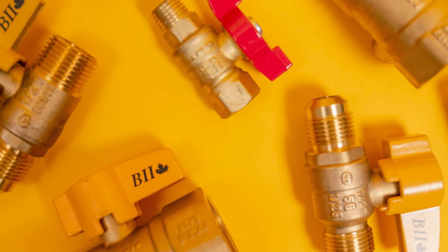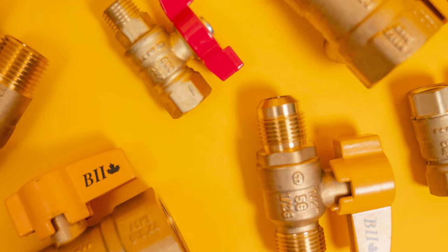Let's talk about the different types of balls. There are three different types of balls that can be found in ball valves. For each of these three types, the outside of the ball needs to be smooth and the surface gets ground down to remove any dips or imperfections. As the material cools, the shape may change resulting in more or less grinding. The three types are hollow, solid, and cored. The hollow ball has a cavity that goes from an open hole in the bottom of the ball to the top where the valve stem is inserted. Hollow balls require less material to construct, making them more economical, but may require more grinding to get the dips out.